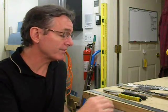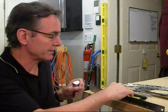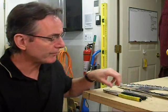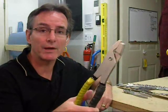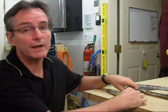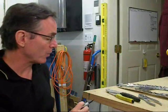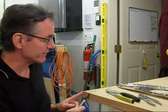To use this method, I needed three things. First, I needed a flat surface. My workbench is very, very flat, and as a result is suitable for the task. If it wasn't flat, I would have put a piece of plywood or other flat material on top to use as the working surface. Second, I needed a pair of fluting pliers. And then third, I needed a pair of conventional pliers. Before I started, I made one mark on my workbench, which is two inches from the edge.